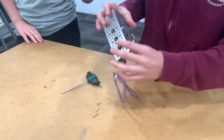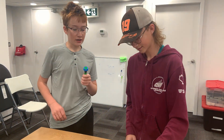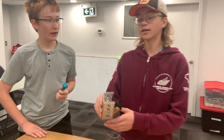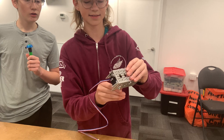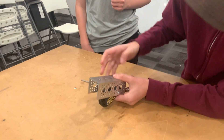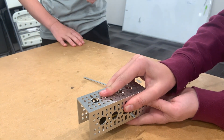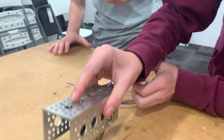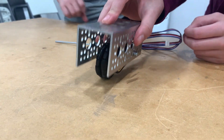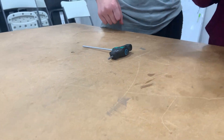And that is how you build a dead wheel. Now, one last thing — I have noticed that as you're building, the spring made it push down. Why would you want the spring on that? So, your robot has... it's a bad idea to keep your dead wheels in one fixed spot, because if they're too low, your wheels won't contact the ground, and if it's too high, your dead wheels might not contact the ground. But with the spring, it gives you a variable height, so that no matter what your wheel height is, it will always contact the ground with enough force so that it rotates on the field.